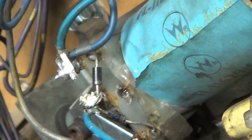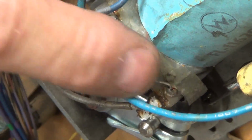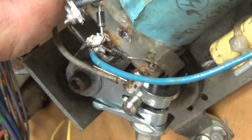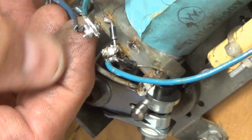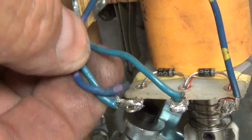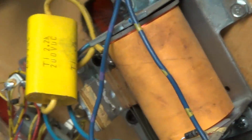Yeah, that's right. I look at the wiring and what was done solder-wise, and I don't know what was going on there, but they should have replaced the coil. Somebody should have, anyway. This type of thing is what you're looking for. You don't want to leave it in there because it's poor work, and it doesn't really even have all the conductors on it. It's nothing that broke off during use either. These were never soldered on. The diodes and the solder work should look better than this. I don't know why that was left alone.